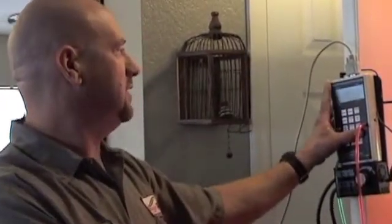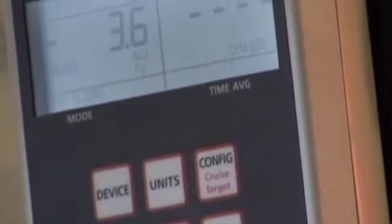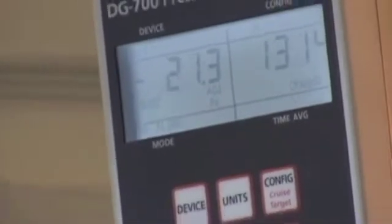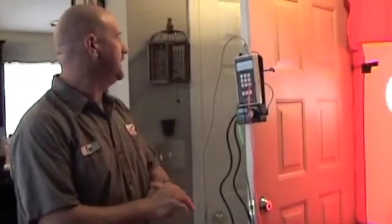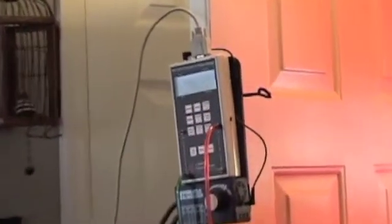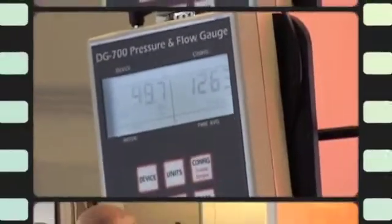The gauge itself is used on a multitude of devices. We use the DG700 on our blower door and also on our duct blaster — it's also what we use with the pressure pan. What this does is it automatically brings it up to 50 pascals. We can tell how much we're actually leaking inside and how much air is infiltrating from the outside into the house. Right now we're sitting at 49.5 pascals and we're leaking about 1,250 CFMs being infiltrated inside the home.